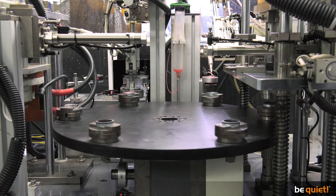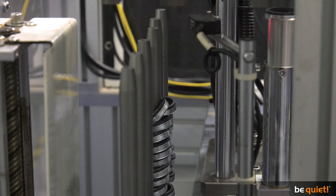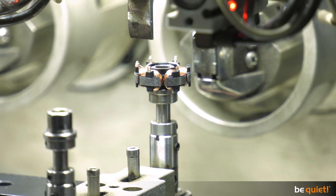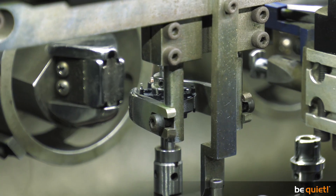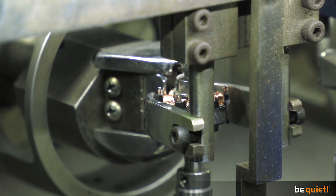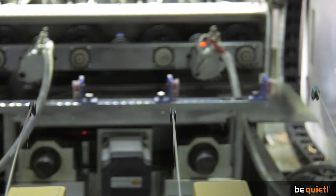Let's start with the production of the magnet band. To create this, a metal piece is being pressed fully automated into a tin plate and charged with magnetic tension. This fixed band includes the coils which make the fan rotate by being constantly triggered by an intelligent electronic circuit. The amount of copper decides how fast the fan can rotate — the more copper wire you use, the stronger the magnetic field and subsequently the higher the possible rotation speed. It takes about a minute to equip all six coils with a precise amount of copper wire each.